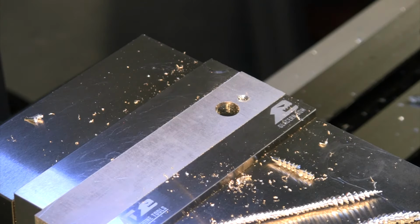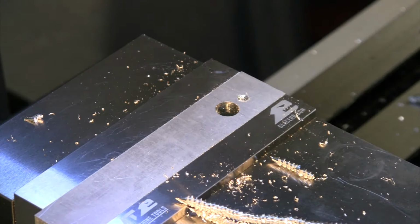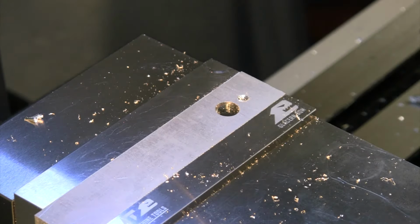And that was after totally destroying the tip and the cutting edge on that drill and then grinding it and saving it from what would have been a total loss. You could have just about chipped the end. We probably took a good eighth of an inch off the tip of that drill, grinding that back, and still got it to cut just like it was brand new almost. Let's go back and take a look. That was a medium-sized drill bit, and we'll try sharpening a really small drill bit and see how that works for us. Let's head on back to the grinder.